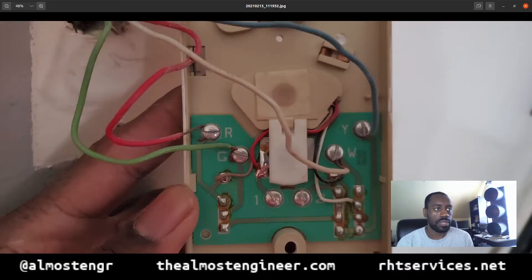This is the backside of that thermostat. As you see, there is an R, G, W, and Y wire. Those wires each represent a signal that is sent back to the control unit. Red is your positive 24 volts. Some systems use a variation or range — ideally your air conditioner system will use 24 volts, however that can vary from about 26 to maybe 18.